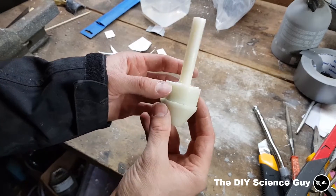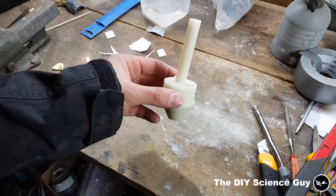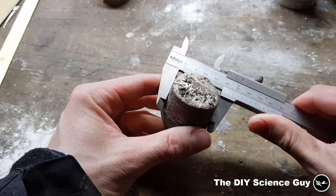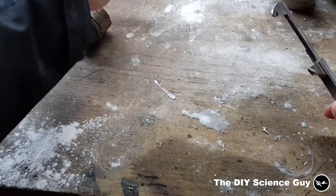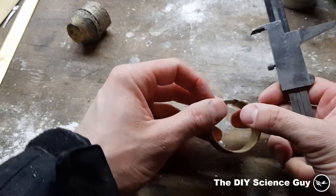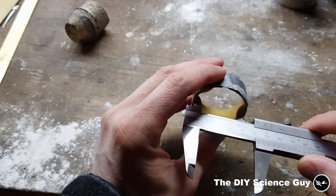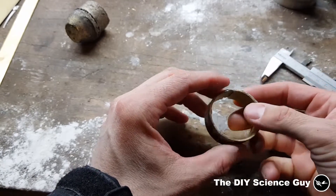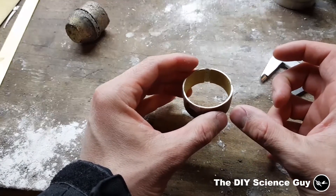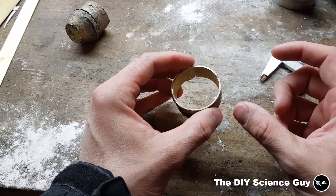So I've made a new wax piece. But before I put it in a mold, let me first show you what I changed about the measurements. This casting is about 40 millimeters and needs to be 41. So the wax model I made — I just cut this piece of brass here and widened it a bit, so it has now a diameter of 42 plus something. Taped it off with a bit of duct tape. So the wax piece that is now going into the mold is one millimeter bigger, so that after casting the brass, when the brass shrinks, then it will have the right size. I hope.